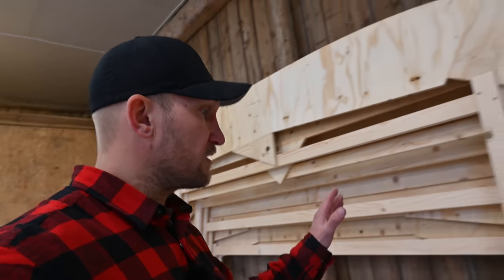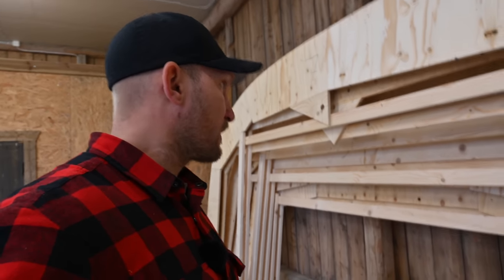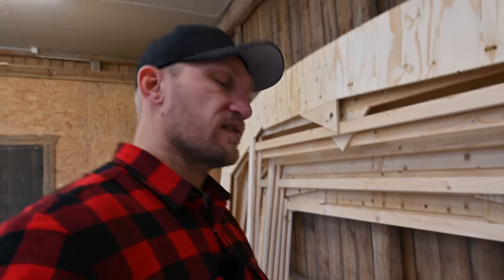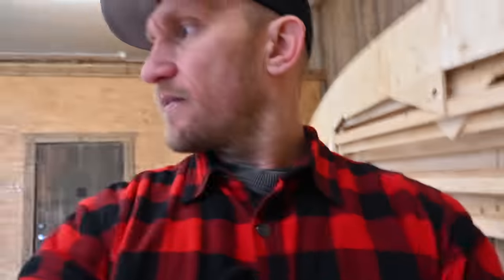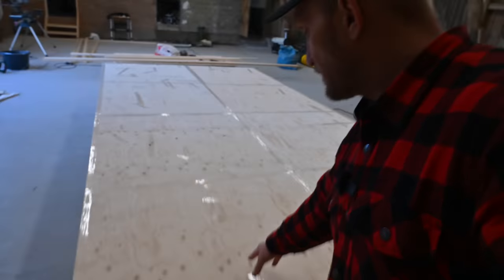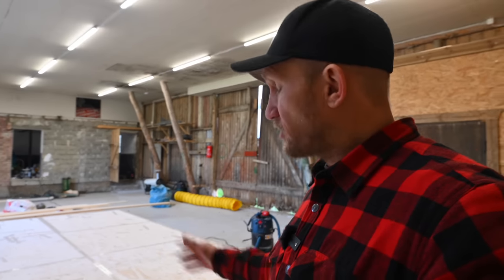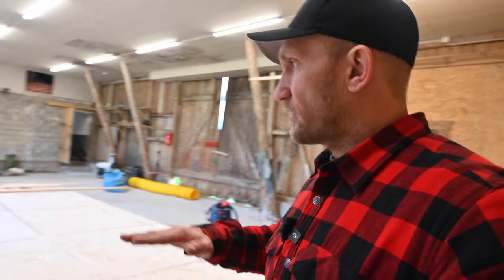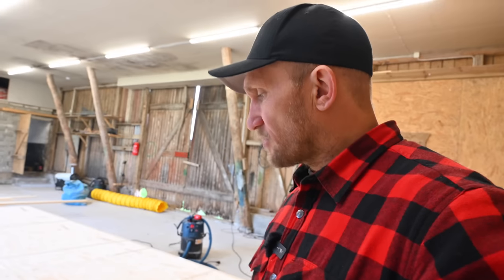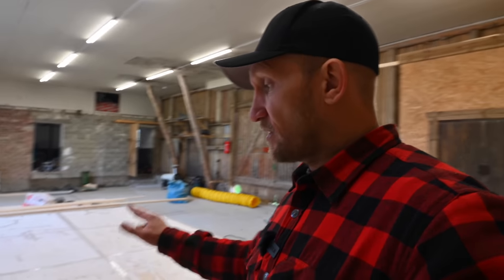The accuracy on all of these pieces has been really good — all of them are within one to two millimeters of the total width, which is really nice. One thing that has made this whole thing take a bit more time is that the table isn't perfectly flat between the wooden beams underneath. The plywood is sagging a bit in between, so I have to make measurements on every piece to make sure it's perfectly flat and coplanar, putting small thin wooden pieces underneath every piece I've been scanning and cutting.